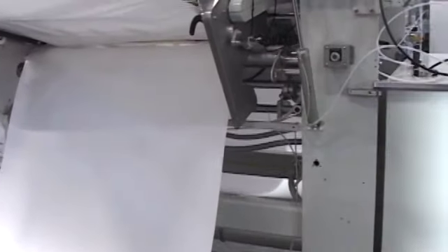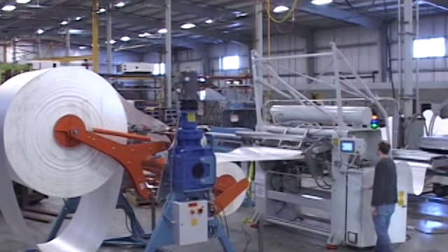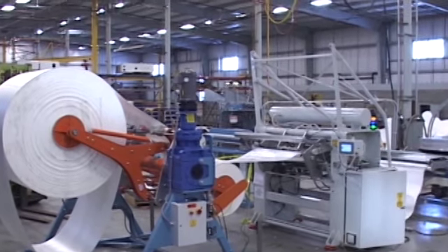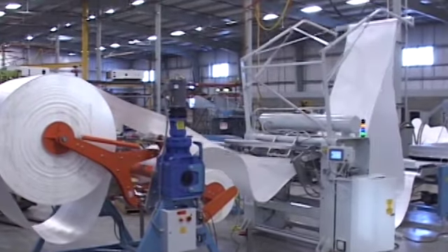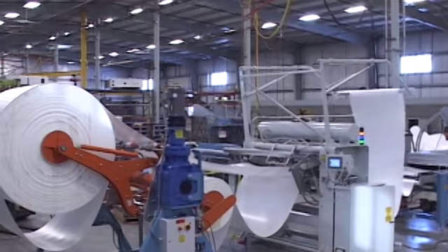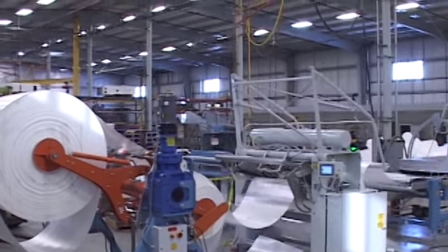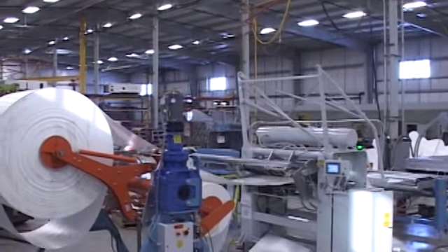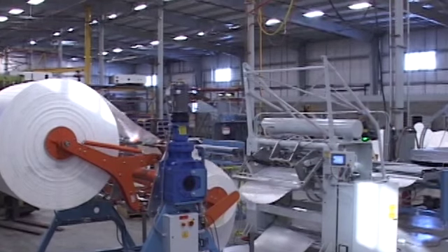As your machine is running and the sheet gets low, you'll see a photo-eye. It'll automatically start the excess feed that you're seeing now. The arm goes up on the exit side to accumulate while the former is still getting in the heat tunnel, getting a constant flow of sheet. The splice is happening. It'll reverse, the sheet will fall off, your new roll will start going through the machine, and you have a constant flow of sheet.